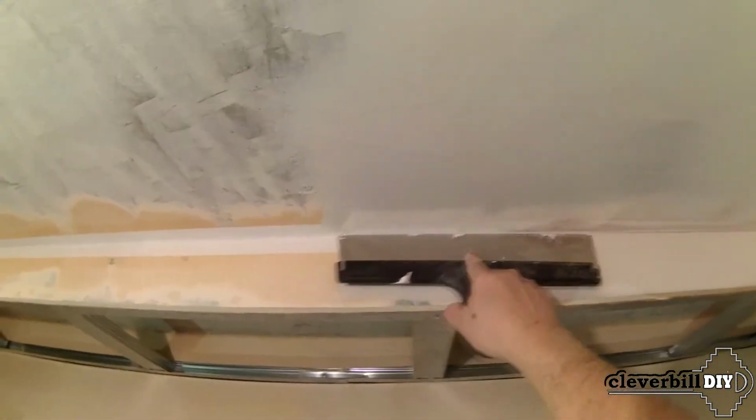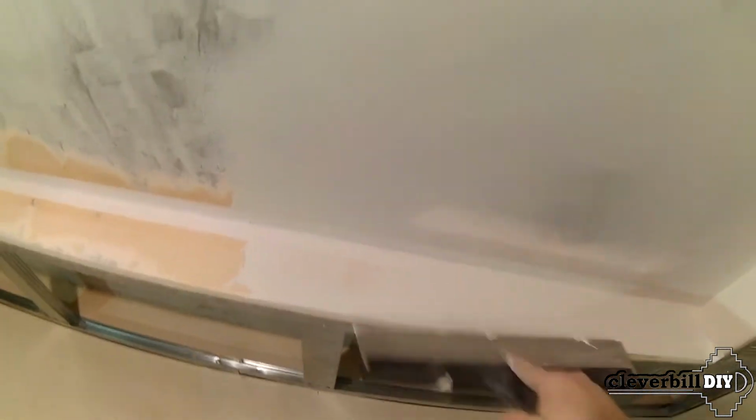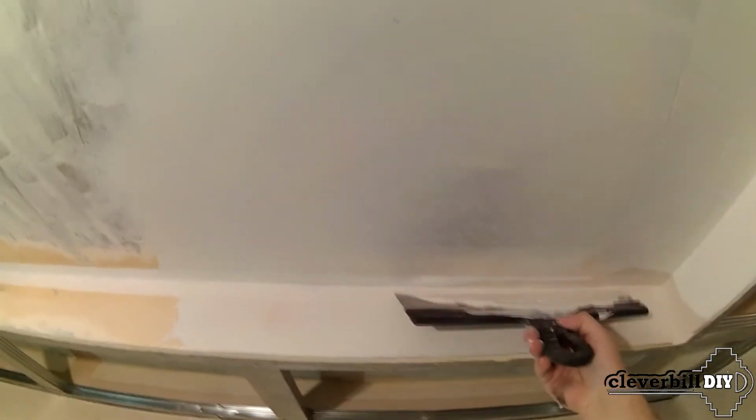I would like to say for beginners in this business, there is no need to try to cover the ceiling with the first layer of putty so that it immediately becomes perfectly even. The putty will be much smoother and easier to lay down in the second layer. The task when applying the first layer of putty is to cover the base, close all micropores and cracks. I will not talk about large irregularities, since a plaster mixture is already required here.